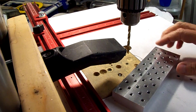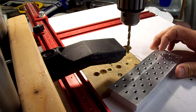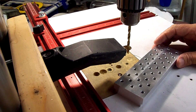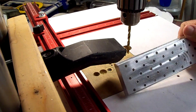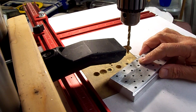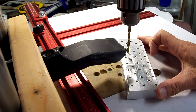I've got these holes drilled with a number 21 drill bit, which is the bit for a 10-32 tap, which is what I'm going to tap these holes with. But this thing's about three quarters thick and I don't need the threads to be that long. So I think what I'm going to do is counterbore it on the back a little bit bigger so that we only have to have about a half inch of thread, to make it a little easier to tap also.